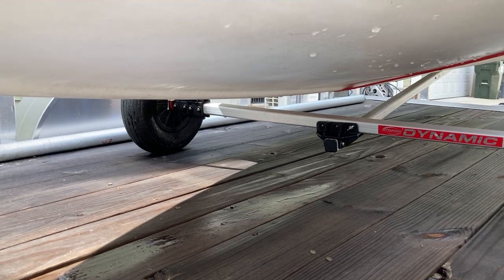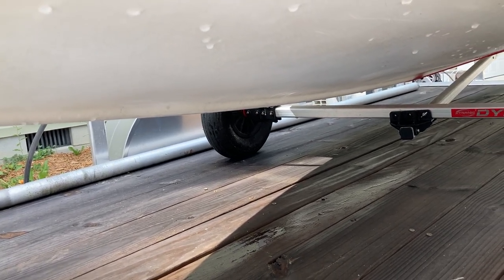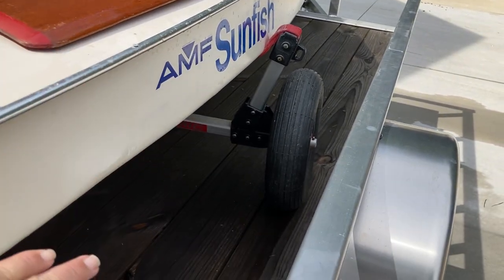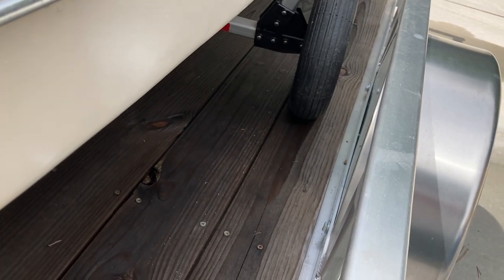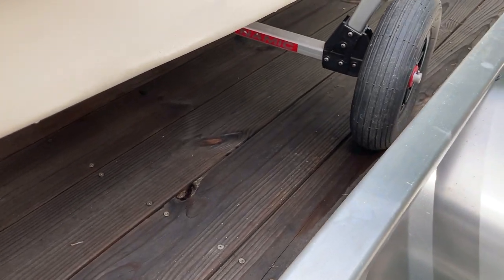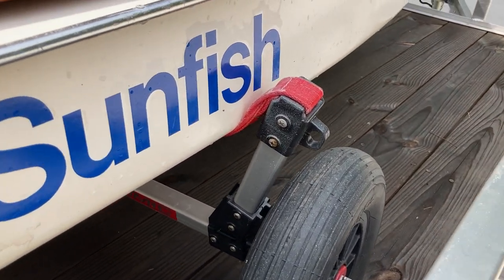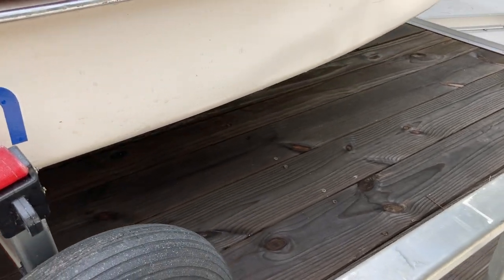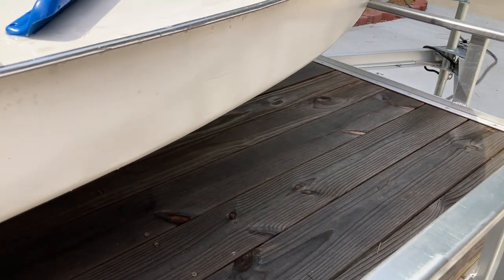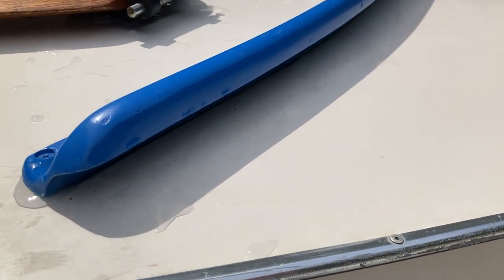When you're cleaning your boat, don't forget the bottom. We haven't wiped down the bottom in quite a while and it felt pretty rough. We'll need to get the boat flipped over and do a better job of cleaning underneath, because all the rain that comes down hits your cover, rolls off the side, gets on the boat, and runs underneath. After a while you can start to have moss or lichen growing underneath. You're not going to go as fast if the bottom's dirty. Especially in salt water, get that crusty dried salt off. Some lakes also require you to rinse the boat at the ramp so you're not taking invasive aquatic species to the next lake.